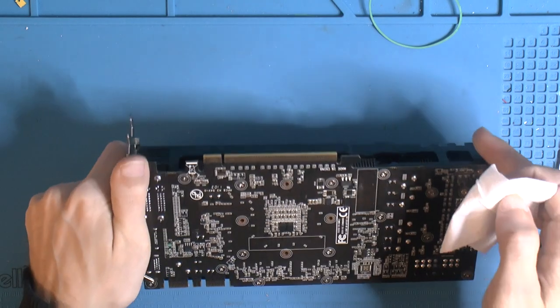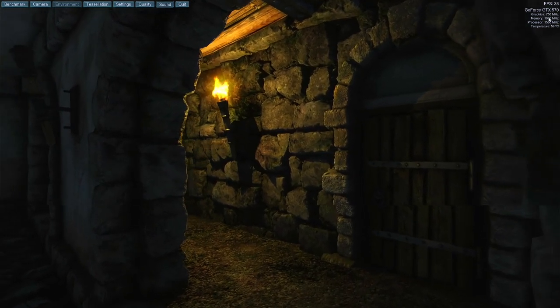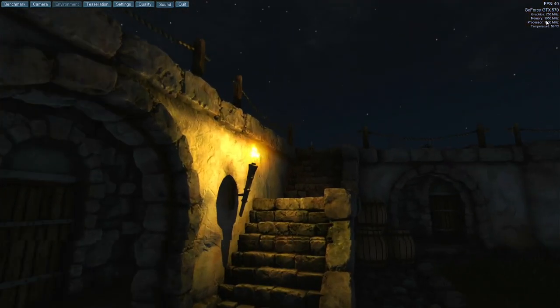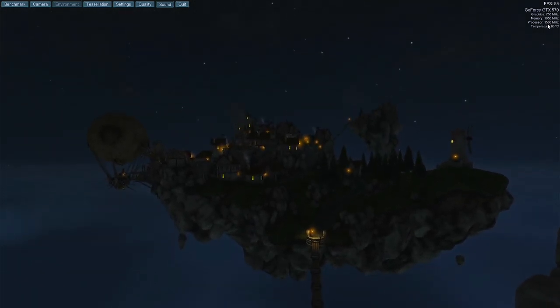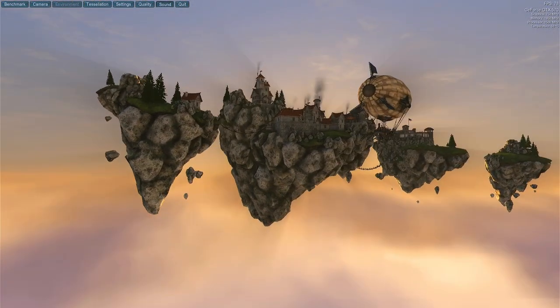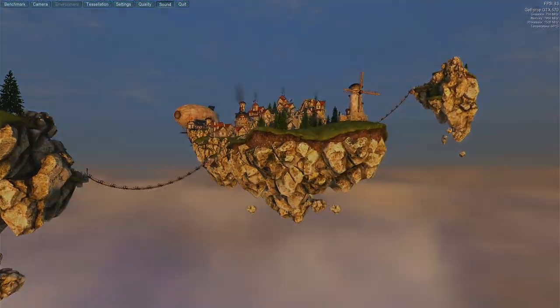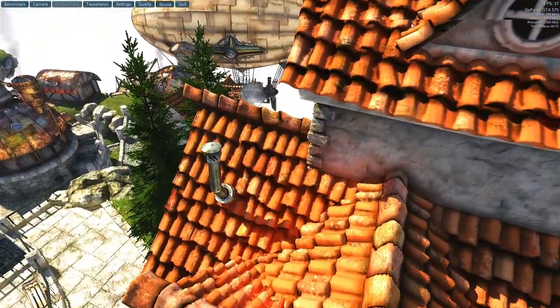Really hard to tell. It's got some paste there, I think. You can see up in the corner here, around 60C. So we're running at a base graphics clock of 750 MHz, which is a little bit of a step up for a GTX 570. This is factory overclocked. So I've got memory at 1950, and the processor, I think, is not the CPU, but it's actually the graphics core. It's twice the base. We have our graphics clock and basically a shader clock, I think it is, on the Fermi. So yeah, it's around 60, and this has been running just fine, like I said, so we can quit this.